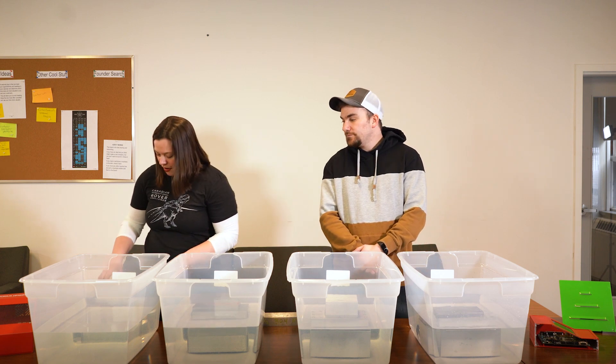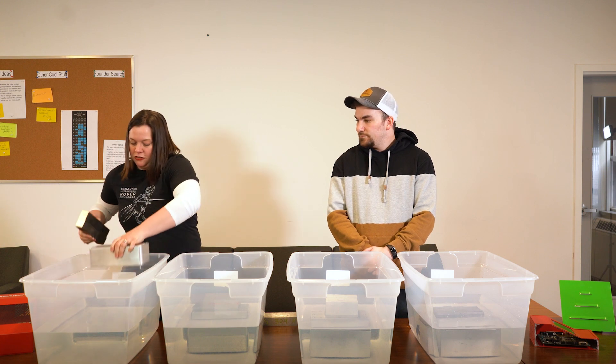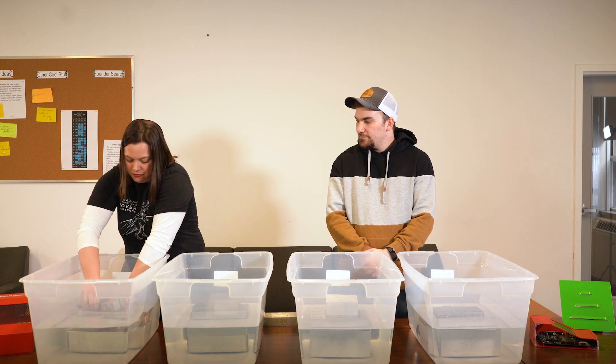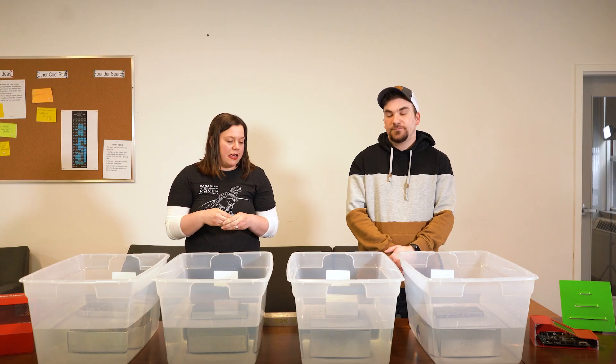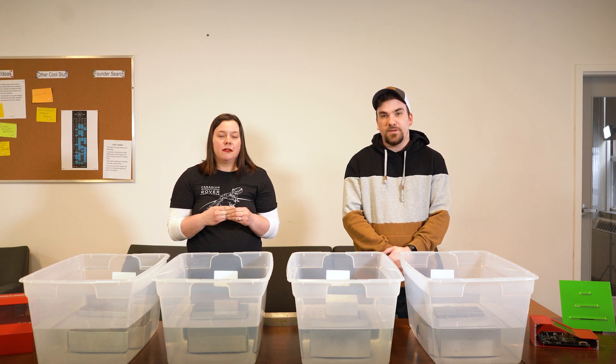Finally, we have our CNC machined enclosure, which has an O-ring gasket. Now we're going to leave these in here for ten minutes, and then after that we'll take them out, open them up, and see if there's a color change in the pH paper.